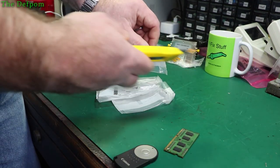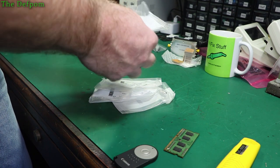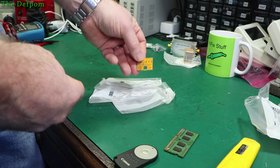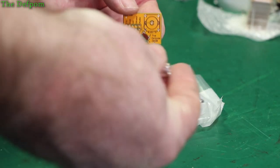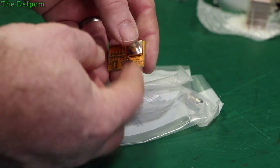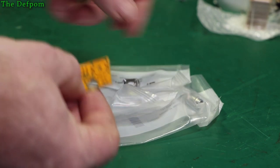In the previous mailbag I had purchased some BNC sockets to use on these boards. However, I made a small mistake — I got the footprint wrong. When I sent the boards in I checked the footprint and realised it wasn't the right one. Rather than getting the boards redone, I bought some more sockets which should actually fit. And yes, it fits — excellent, exactly right. It's just a through-hole BNC socket and it'll go on the boards. So I can start making some boards.